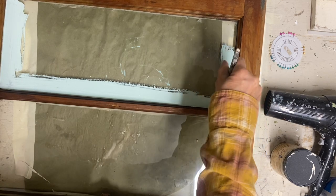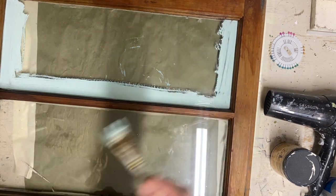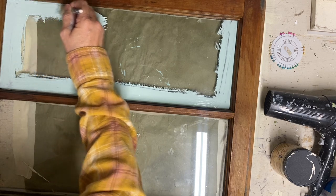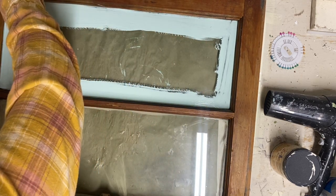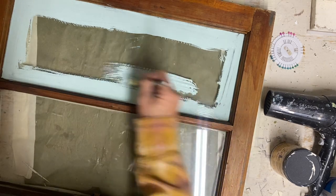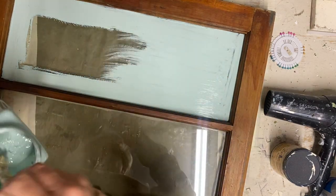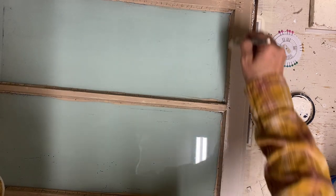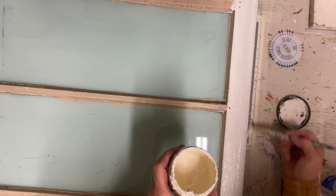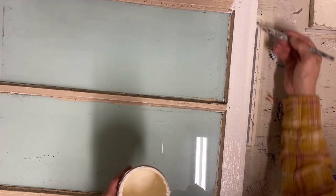Generally when using paint on glass, I would use a Slick Stick or some sort of base coat to help it stick. But this is going to be the back of the window and it's not going to get any wear and tear. So once I put two coats on this, I think it will stay well, especially since by the time it's really touched, it's going to have plenty of curing time. I would normally paint a top coat over my chalk paint, but again, that's just going to be on the back so I didn't feel like it was necessary. Now I'm giving the window frame on the side I'm going to be using two coats of the color buttercream, and then I'll let that dry well.